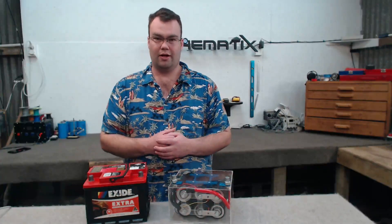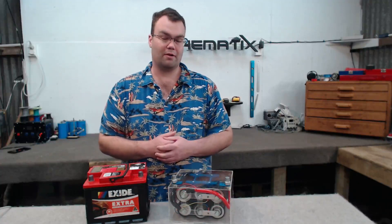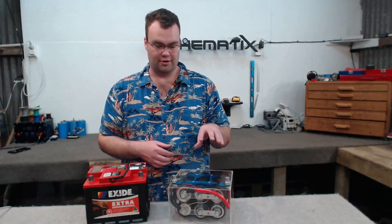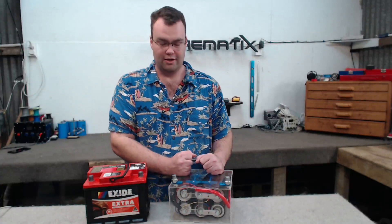In conclusion, is it practical to replace your SLA battery with a super capacitor bank? Not for me, not quite yet. If you have an aftermarket car alarm that uses a little bit of power to keep everything working, you're going to struggle with the capacitor bank. My car alarm will flatten a regular battery in two to three weeks, so I'd hate to think how quickly it could discharge this capacitor bank with its rather low overall energy storage.